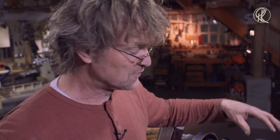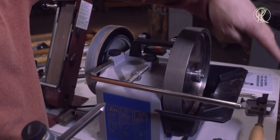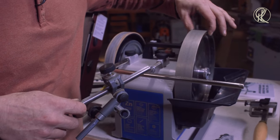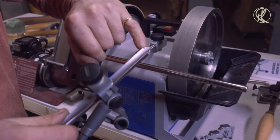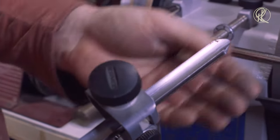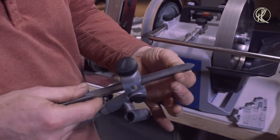I'm a fan of CBN wheels, and one of the reasons I have a CBN wheel on my Tormek is that I no longer have to use water in the container. Tormek normally sells these machines with the traditional stone or with a diamond wheel. The result of CBN, diamond, or the stone is exactly the same — they give you a perfect bevel. A small disadvantage of this steel wheel is that very fine steel particles are sharpened off, and because it runs so slowly the tip gets a little bit magnetic, so you have to get rid of those particles.